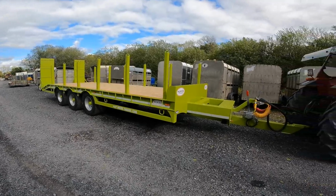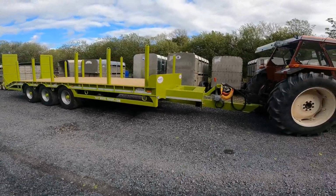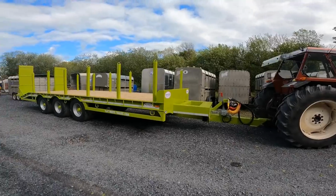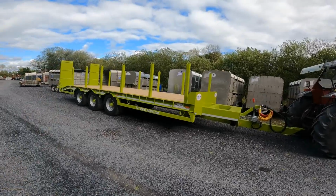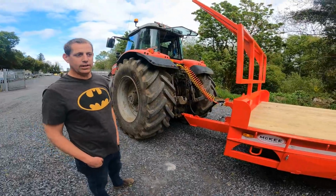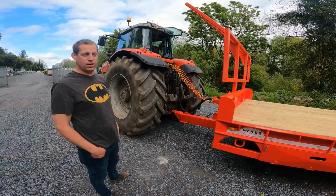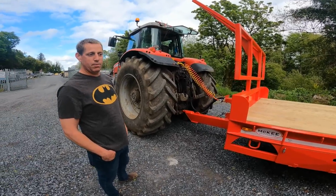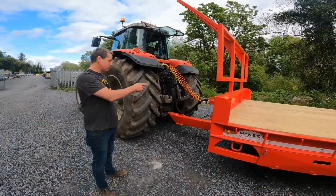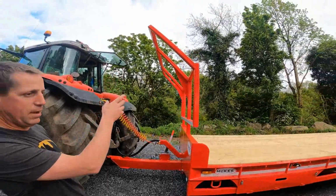And a great finishing stuff. You can feel where the whole trailer was blasted. And then you can see two-pack paint and undercoat. It's a 27-ton tri-axle low loader, run on a 10-stud commercial axle, air over hydraulic brakes, 445/45 by 22.5 baby balloons, very smooth on and off road. Fitted sprung drawbar, your breakaway system, your air pipes there, removable bale rack.